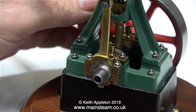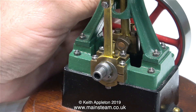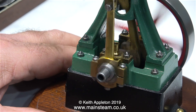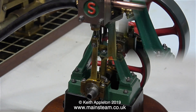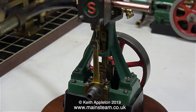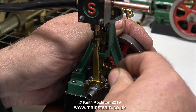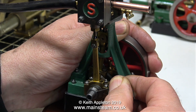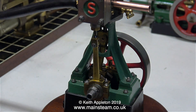Why not? Well, it's a good idea to admit the steam or compressed air early so it cushions the reciprocating masses. The problem is if you set the admission too early, then the engine doesn't run very well slowly. So on small table engines like this, it's a little bit of a compromise. I've taken my medication and filled in the forms to accept me back at the asylum, and here I go with the Allen key to adjust the timing. I'm moving the position of the eccentric sheave to advance the timing — moving it to the right, only a very small amount. If I move it all the way round, the engine will go in reverse. I've moved it about a sixteenth of an inch or so.